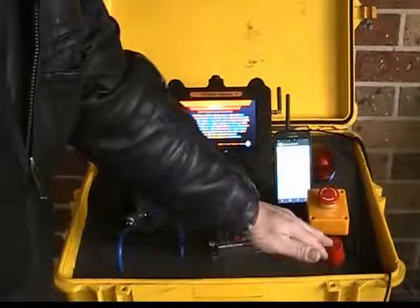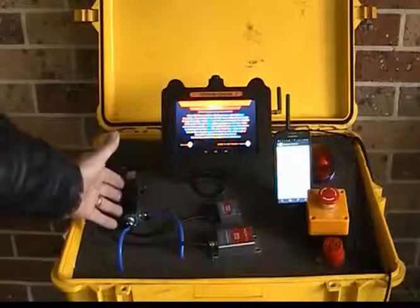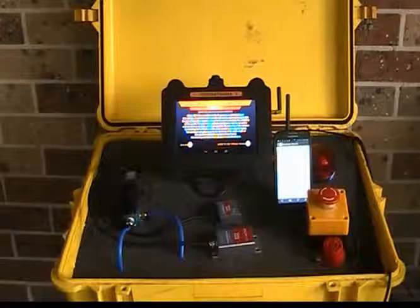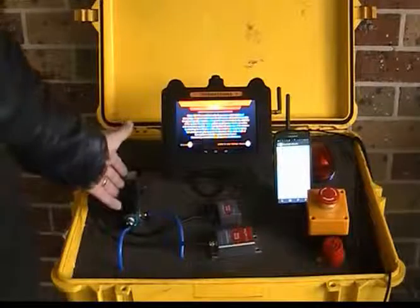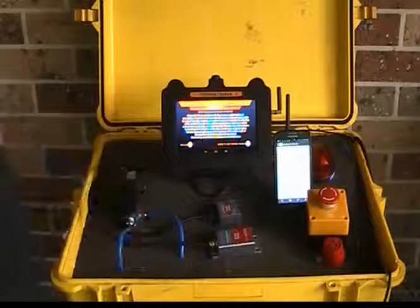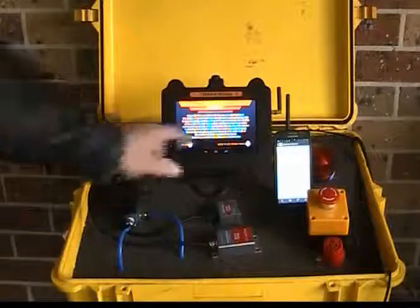This is just a beeper, and behind here you see the flashing light, and here is a valve which we have on one of the relays. If the tipper bed is raised when the machine is on a steep slope, the valve will activate and will interrupt the raised hoist circuit so that they can't raise the hoist in a dangerous slope situation.